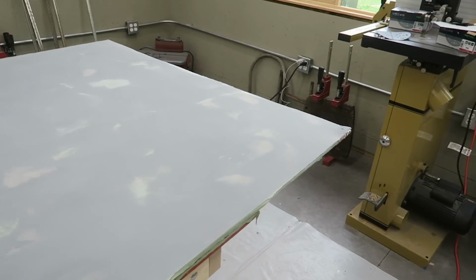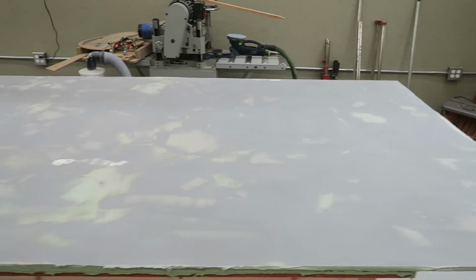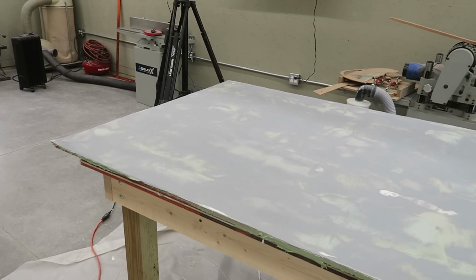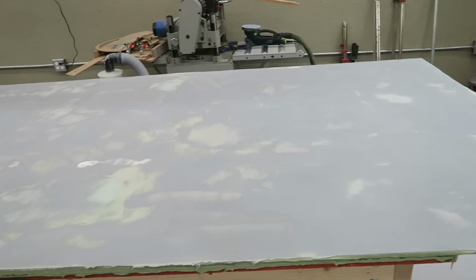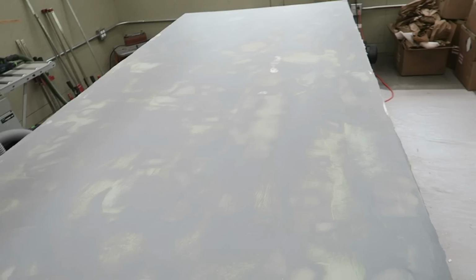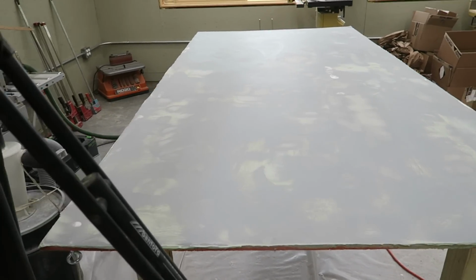Because what happens is that every time you come through and do one round of pinholes, when you sand this surface, you run the potential of opening up more new pinholes that then need to be chased down and sanded back down. So it's a little bit of you go round and round for a while, and again, I've said this I think 3 times already, but the devil is in the details. This is one of those steps that if you are not very, very diligent, it will show on your final product.